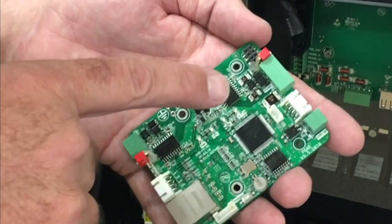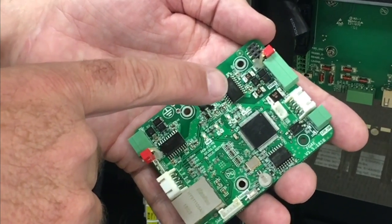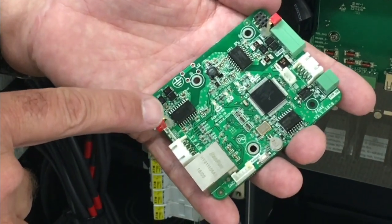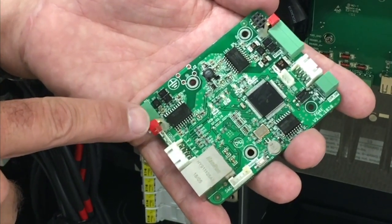Also, a 5-pin RS-485 connection for the daisy chain network to up to 70 CPS 5060 inverters. And lastly, a 3-pin pass-through port that allows Modbus RS-485 for communication to a third-party data logger.